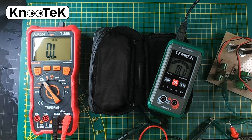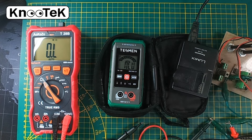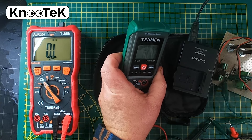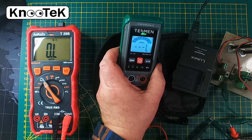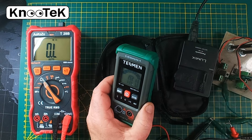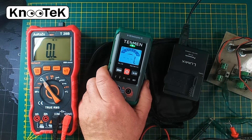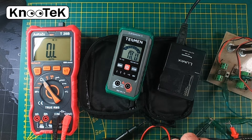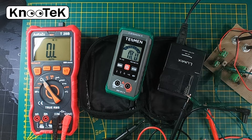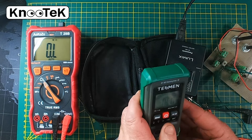It's a great tool for isolating problems. However, I'd never consider non-contact voltage testers 100% accurate. I haven't had a false reading from one, unless the batteries were too low — and low batteries can give a false sense of security. So once you think you've isolated the circuit, always double-check using the actual probes, sticking them into the positive and negative of the socket, and confirm it's live or dead. Otherwise you might get a nasty belt — that'll ruin your Sunday roast.